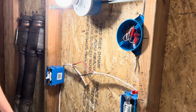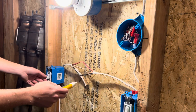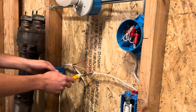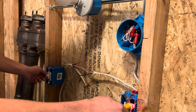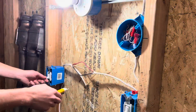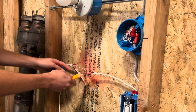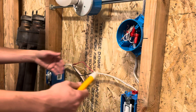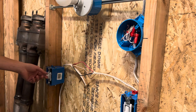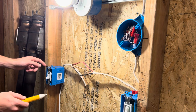When you see the light on, the power is on the black wire — no power on the red. The power is coming from the power source through the switch, through the black wire, up the switch leg, up to the light. When I turn the switch off it cuts the power off the black, and now the power is sitting on the red wire. It transfers: if I turn it off here... thought that was going to work differently. Originally the power is on the black and goes up through the switch leg when it's on, and when you turn it off it's on the red.